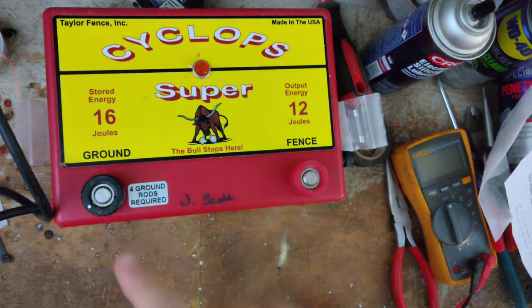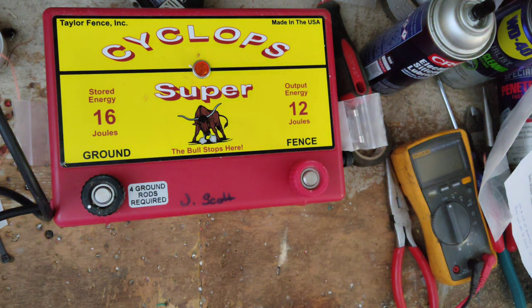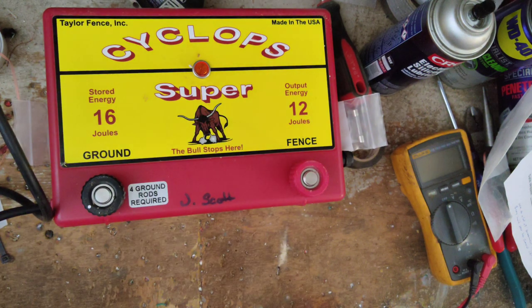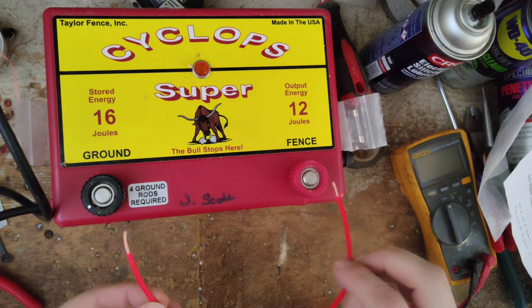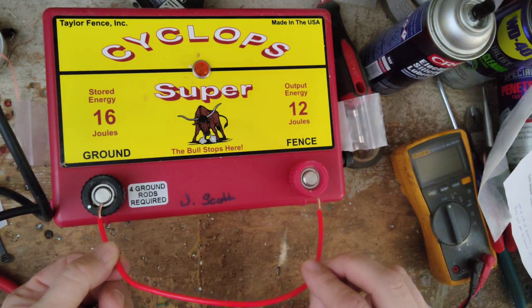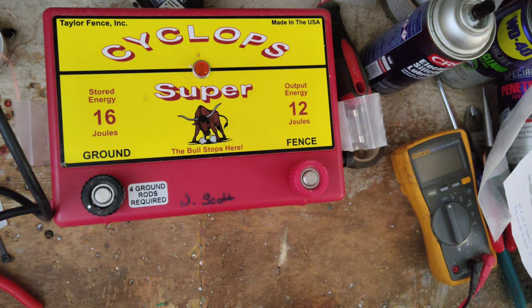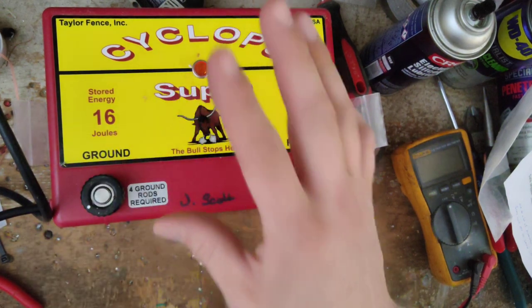Let me find a piece of wire that we can jump across there and strip it off. They have a pretty hard snap to them, a pretty bright spark. They've got pretty big, heavy-duty transformers in them. They don't go bad too often unless they're older or lightning gets a hold of them. Sometimes the transformers will get hit on the fence and ground side and cause them to short out. Going from ground and reaching over close to the fence side — hard-hitting unit. For whatever joule rating it is, it's pretty hard-hitting stuff.